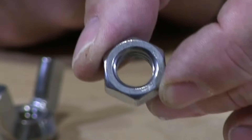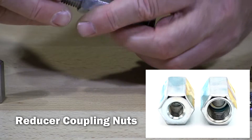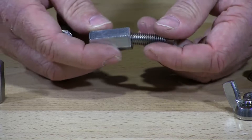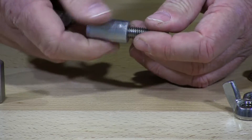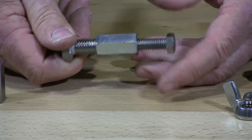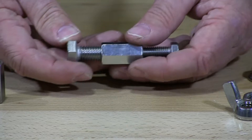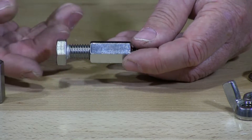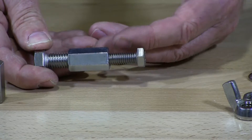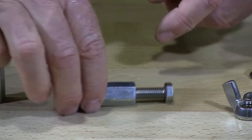If that arrow exists, then it's a left-hand nut. This is a reducer. You can see on one side it has 3/8-16, and this side has 1/2-13. So you can literally go from threaded rod and reduce it down to a smaller size, or the opposite — go from 1/2-13 to 3/8-16. You'd use this reduced coupling nut, as they call it, and that's how it works.